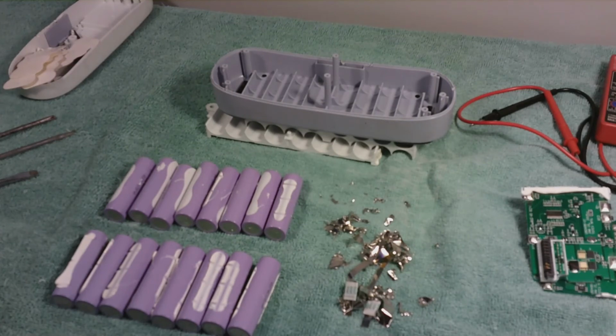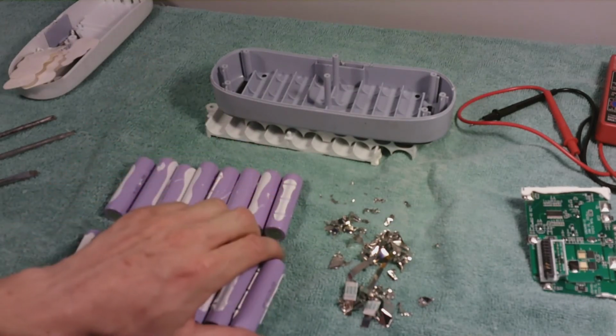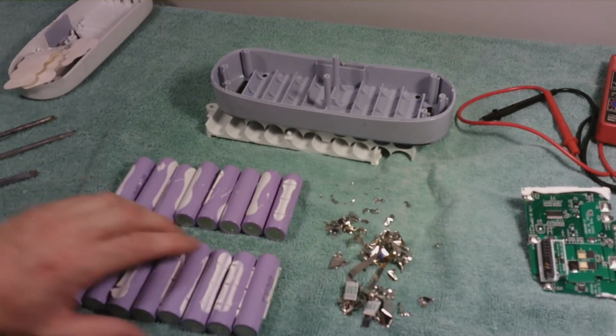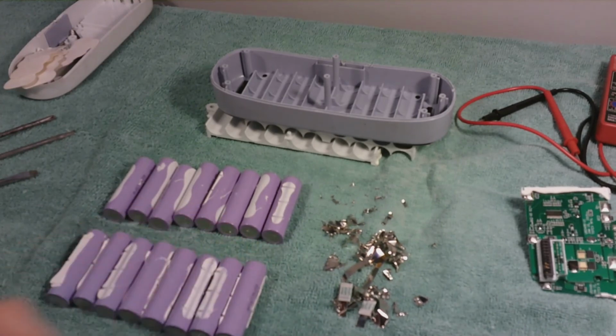That's kind of crazy. Now, one thing to mention, I was touting the LiFePO4 variant earlier for its safety. But again, it is the less dense one, so it takes up a lot more space. And that's the difference: the battery that can power that light bulb for 15 hours in LiFePO4 form is going to be much bigger. I'm not going to give you exact numbers because I don't know them, but it would be a much larger battery to power that same LED string for 15 hours.